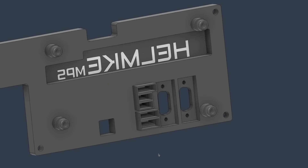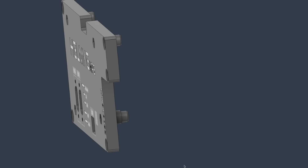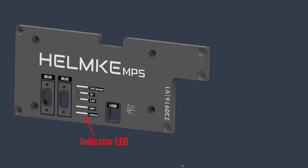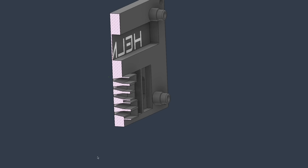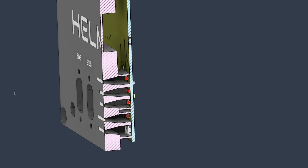The mounting plate uses printed channels that lead to a thin diffuser as indicator LEDs. In my opinion, this is a very powerful and really inexpensive concept. It's not only limited to simple signal lights — for example, you can use this for custom segmented displays, and if you combine them with some flexure buttons, you get an entire interface integrated into the housing, and thereby almost for free.